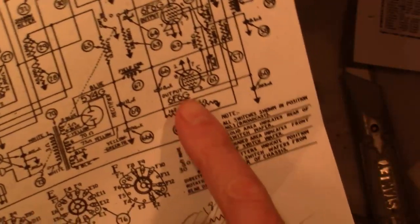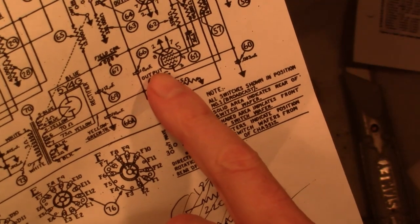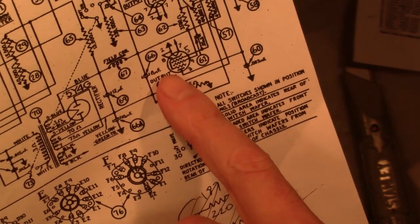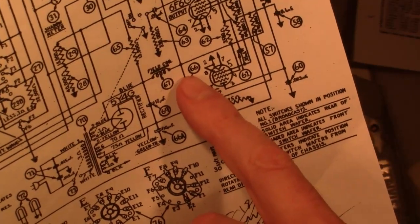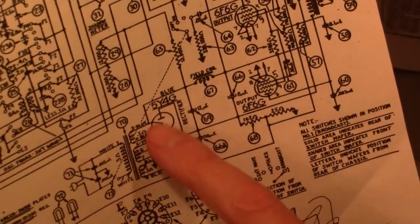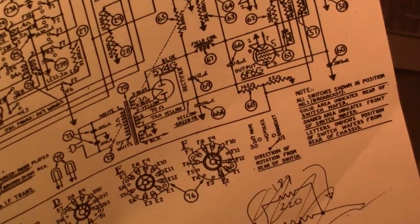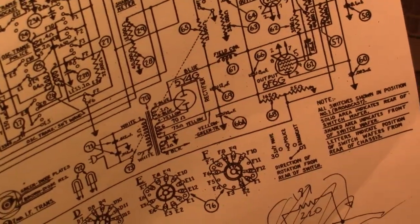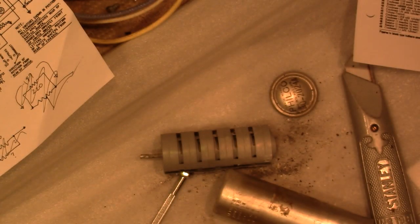It's not a problem to increase this one, like originally it was 8. To put a 10 or a 16 there, no problem, because the field coil has a fairly large resistance and it's going to soften the blow, so to speak, on the rectifier tube, but not this guy. It's right on it, and it acts like a dead short when you turn the radio on. 16 would probably be okay, but I don't think I have any on hand.